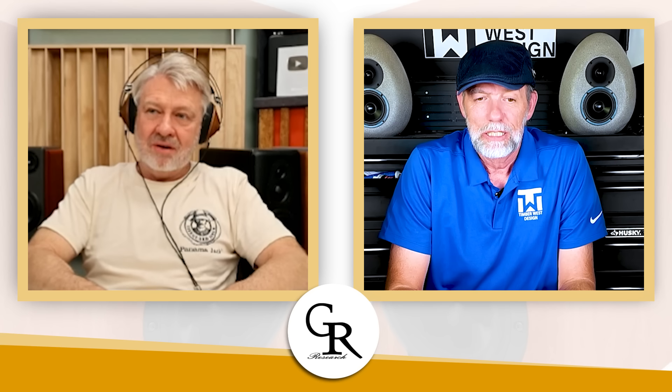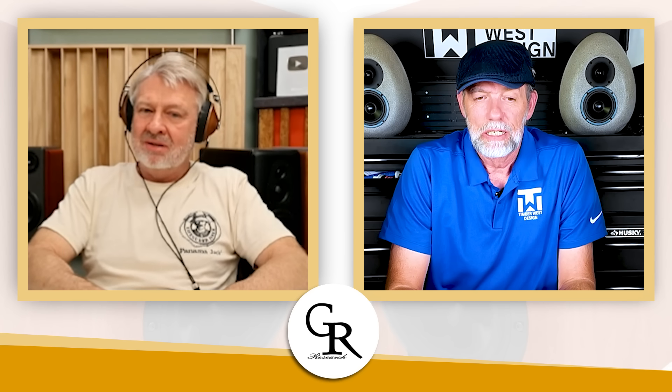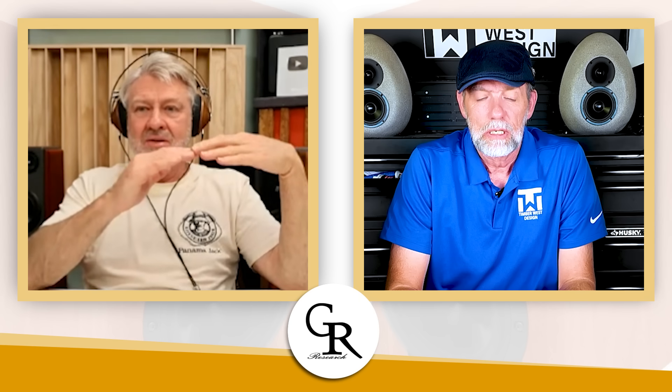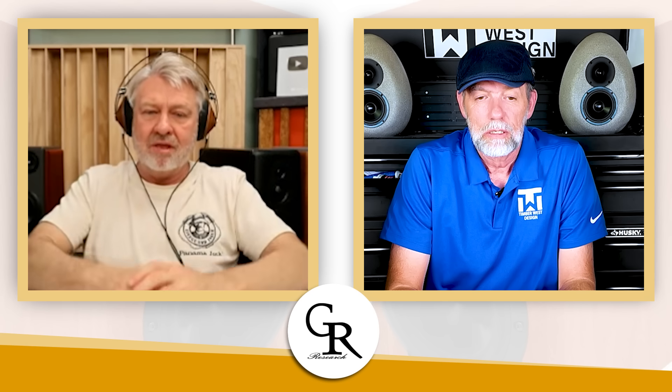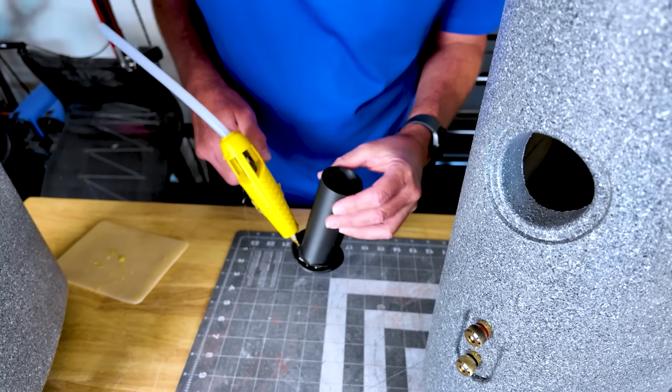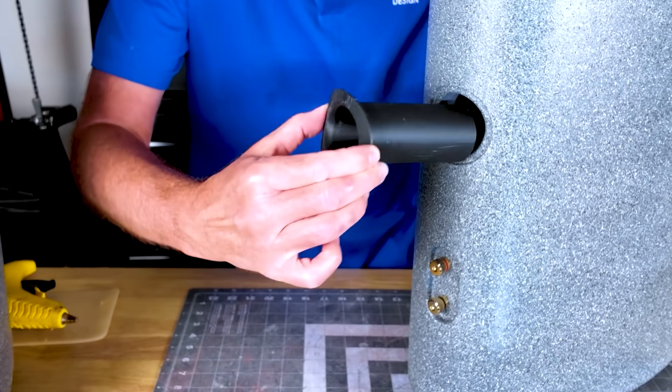You can always go in and shorten it a little bit. By shortening it you can increase the bass response just a little, then it'll roll off sharper — it won't go quite as deep. With the full length you've got, it's going to extend out a little flatter with a more gradual roll off. I did the same length as your current tube for the kit. How much should I cut off? You could start with maybe an inch — that's a really long port. It might tune it a little higher to give you a little more thump and kick, then it'll drop off a little sharper. I purposely just hot glued it in so it could pop out and I could swap it for another one.